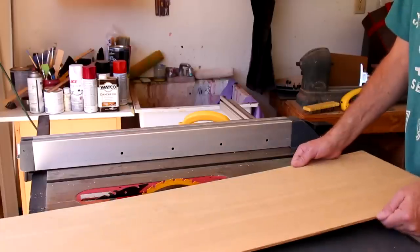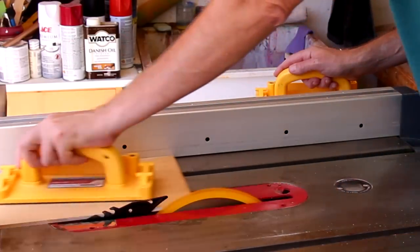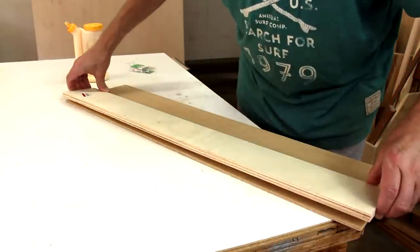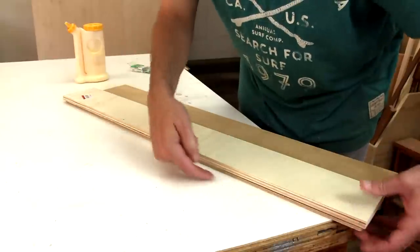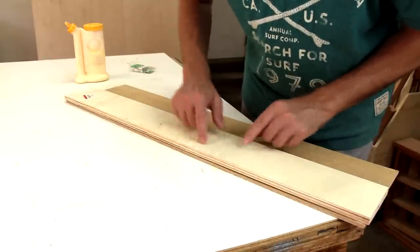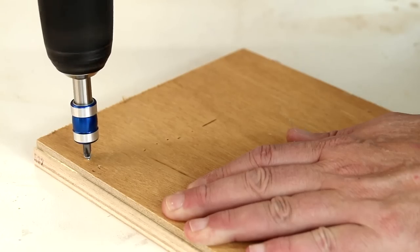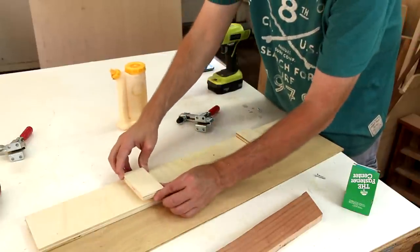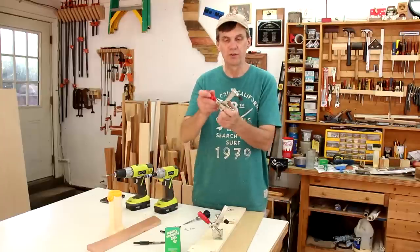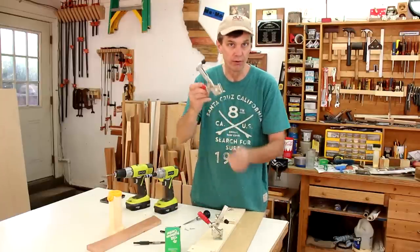And this is a quarter inch piece of plywood that I'm going to rip down to about eight inches wide. I'm going to glue and screw these two pieces together. I'll line these up — I just want to make sure that this thinner piece doesn't stick out beyond the upper piece. I can screw it in using half inch wood screws. And I'll glue these little riser blocks down. Most home centers or hardware stores will carry these kind of hold down toggle clamps, or you can order them online.